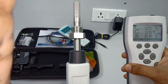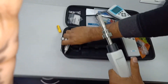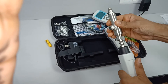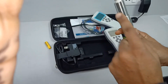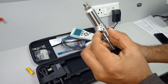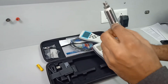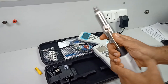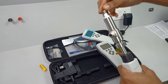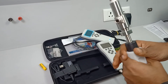This is how we measure dew point in a process. We have the sampling cell which comes with the kit. Plug the sampling cell into the probe. The inlet is where you connect the pipe from the process whose dew point is to be measured. The gas exits from the outlet. This gives you the real-time dew point.